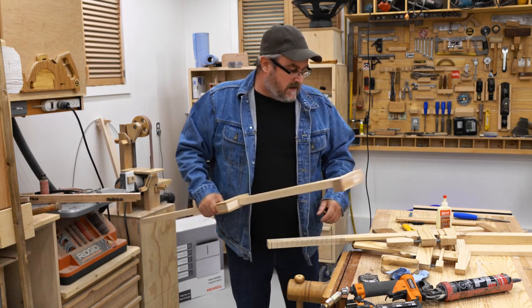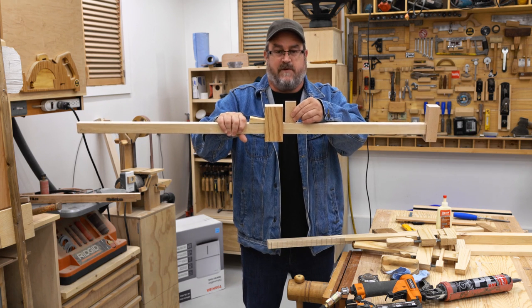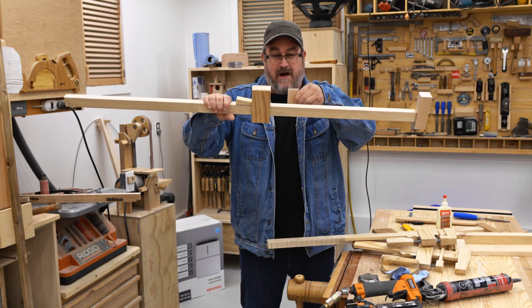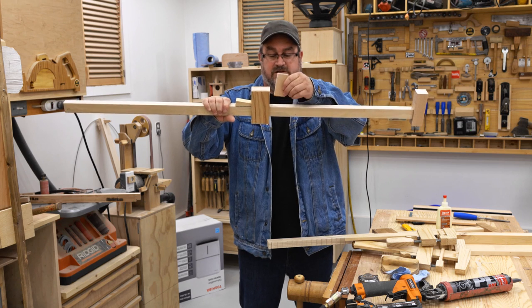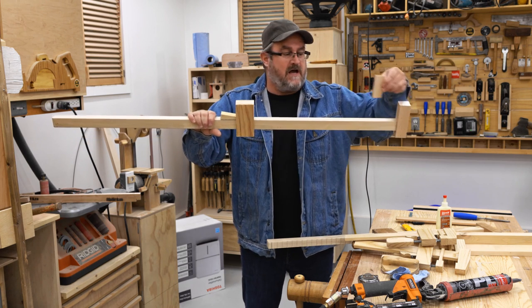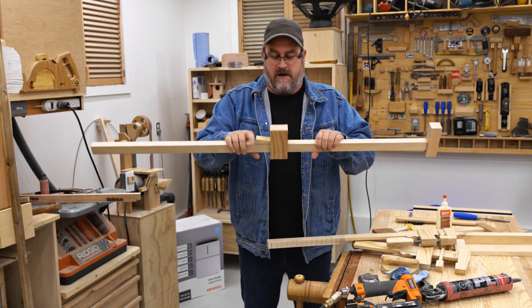What I'm thinking is that the block sits down hard on the bar — it's touching the bar when it's right back in here — so when you're pushing with the lead screw, it's actually pushing it down into the bar as well. That action alone, given the width of the block, should keep the jaws in parallel. That's what I want to try with this one.